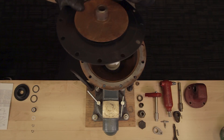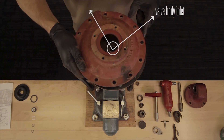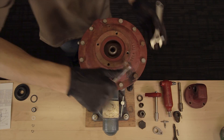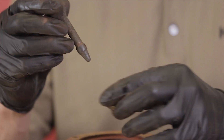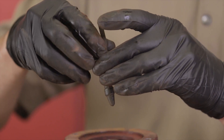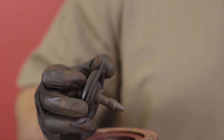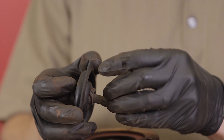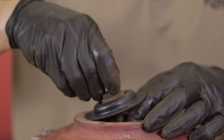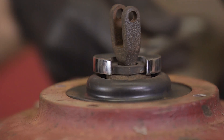Return the body to the vise and place the diaphragm assembly on the body. Place the diaphragm housing on top of the diaphragm, rotate it 90 degrees counter-clockwise from the valve body inlet, and start the nuts and bolts by hand. Tighten the bolts in a criss-cross pattern to avoid any misalignment. Insert the stem into the diaphragm bolt, then the bolt into the retainer with the bevel side facing down. Place the assembly into the diaphragm and put the pin into the stem hole. Hold the stem pin in place and install the stem diaphragm assembly into the diaphragm plate. Tighten the assembly using a wrench, but don't over-tighten as this can strip the threads.